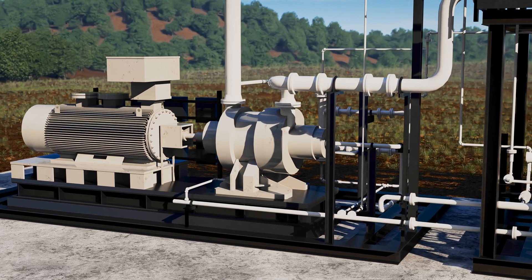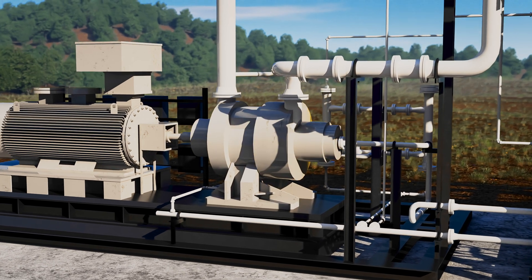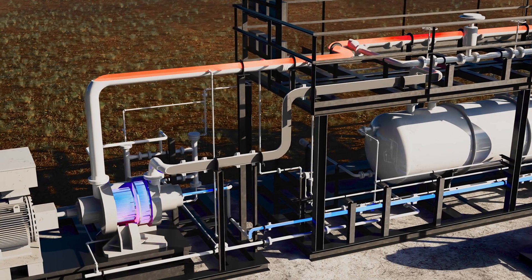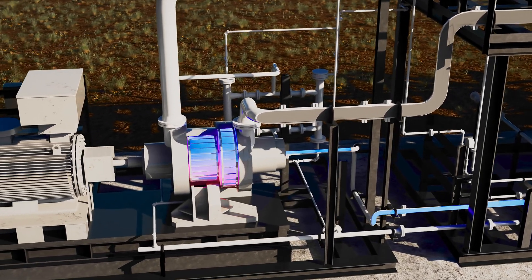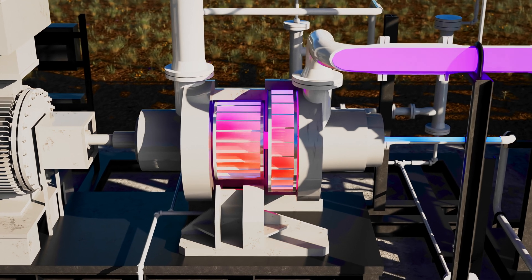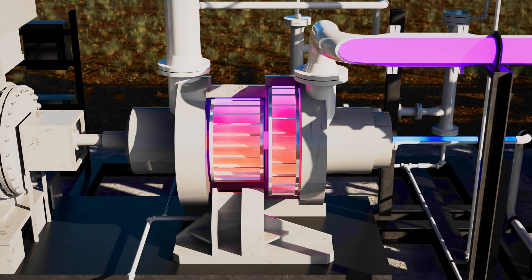The Flare Gas Recovery Process works by using a liquid ring compressor or similar technology to create a suction on the flare header upstream of the liquid seal or safety valve system. Gas is introduced into the liquid ring compressor rotor and passes into the body where water is contained. The rotation of the impeller compresses the gas as the liquid ring converges with the center of the rotor. The discharge of the compressor is a mixture of gas and water.